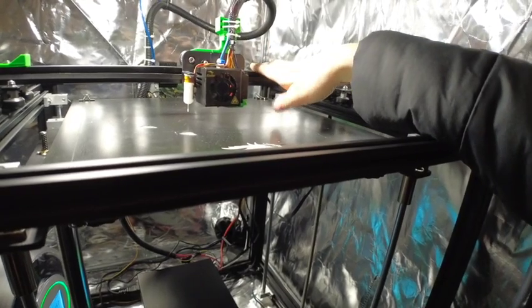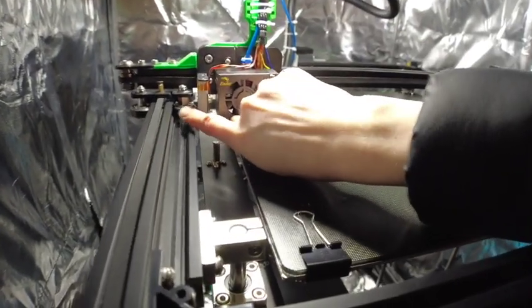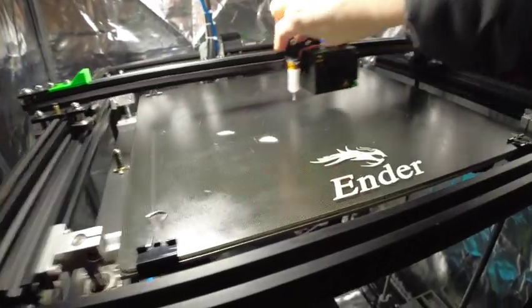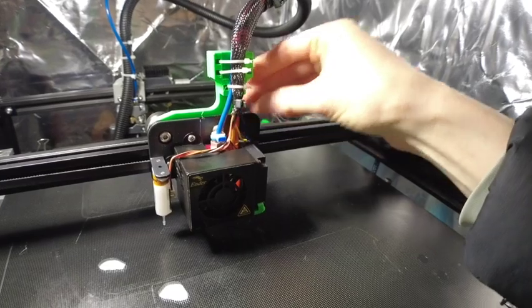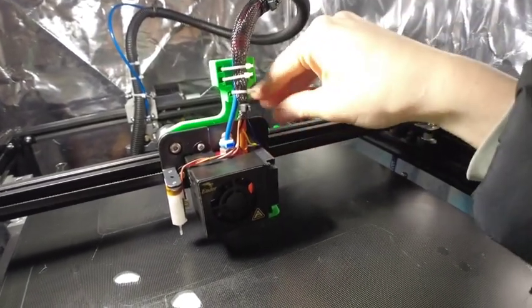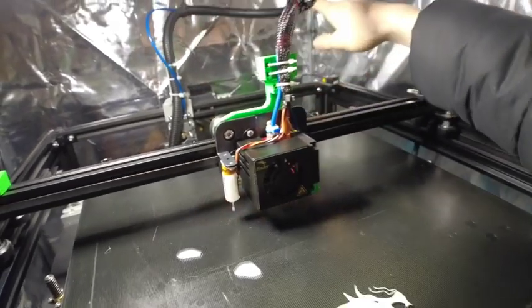Just turn it off and manually bring it back to general center. What the bumper is for is if the extruder runs over to the edge, this part would otherwise bash onto the wheel and break it — I think that's why the pin was bent when I got it. It's a very fragile bit so the bumper just protects it. I've also added a little support for the wires — they are delicate. This stuff is very much component-based and quality is not always 100%, so you just have to give it a bit of love.